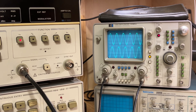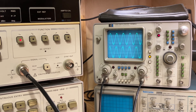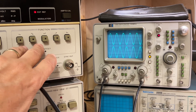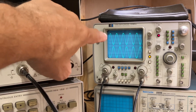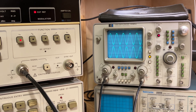What I'm going to do now is take the coax from the external reference input on the rear of my 3325A and connect it to one of the eight outputs on the distribution amplifier, and hopefully we can get it to reference lock. Now you can see the external reference indicator is lit, indicating that the 3325A is now synchronized and phase locked to the external reference on the rear panel. On the scope trace, the two waveforms are synchronized and running at exactly the same frequency. That's how we'll use the GPSDO and distribution amplifier to synchronize all instruments to the same GPS-disciplined oscillator.